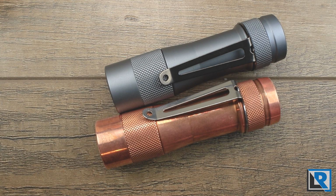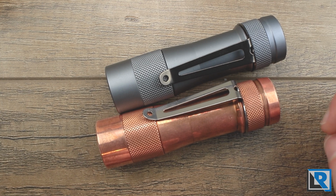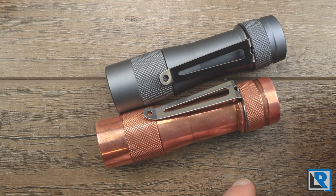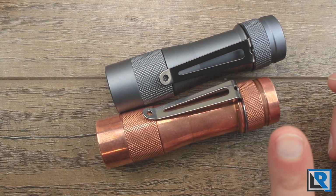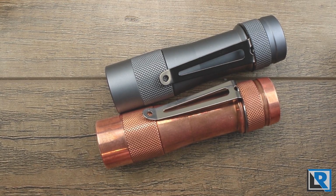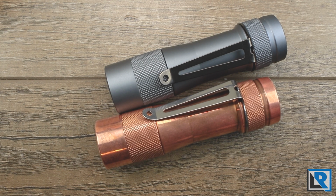Personally, I've been pretty lucky. My original gray aluminum light here worked perfectly. I had zero issues with it. I did tighten the retaining ring in the head to keep it reliable, but I had no problems with it up until then. My copper light, on the other hand, was a different story. I ended up having a slight problem with the location of the O-ring on the inner tube, and after 15 minutes of troubleshooting using that thread, I got it working, and it's been perfect ever since. And as I mentioned, it does have a design revision. It does have a new retaining ring in the head to keep everything together so it doesn't fall apart. That was one of people's biggest problems. Most of these problems that I've seen are usually fixable, but there's also been a couple bad LEDs reported in the first wave of lights too.